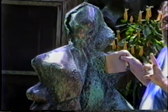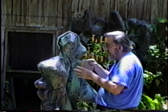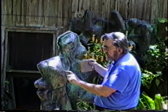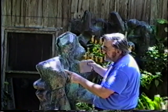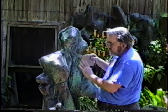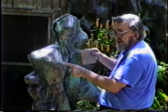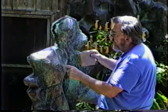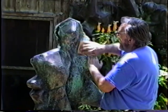If you use steel wool, use only stainless steel wool. The reason for that is if you use regular steel wool, it'll catch in some of the little crevices and it'll leave little microscopic threads of just the raw steel, which you won't even notice. But after a while, it makes a battery and it makes a long, ugly brown streak whenever it rains or gets wet. So if you use stainless steel, if a little thread catches up, it doesn't do that.